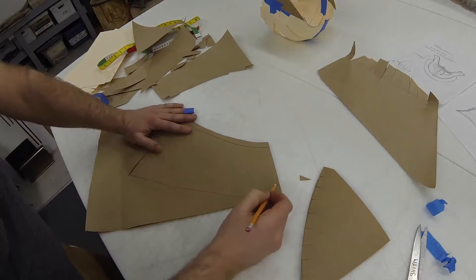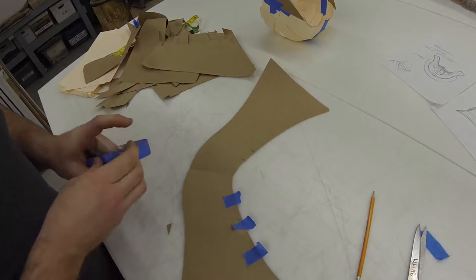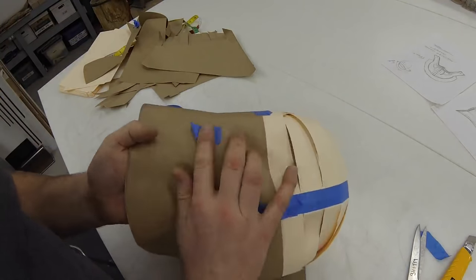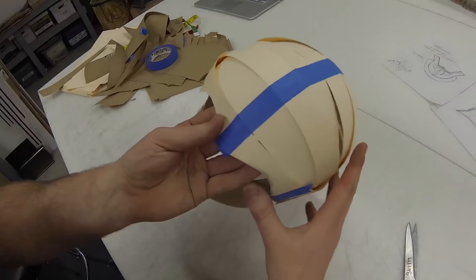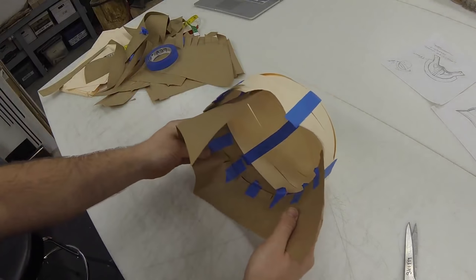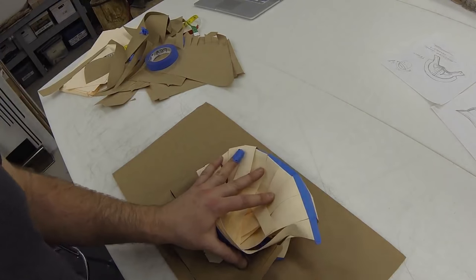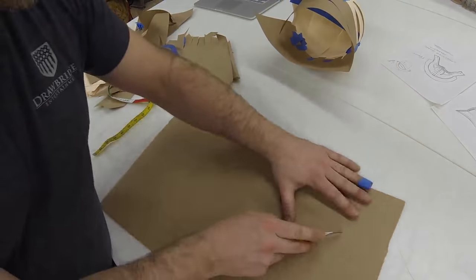The idea of doing a paper helm like that is so that you can get the dimensions of the metal before you cut it, and know exactly how much clearance you're going to have around the skirt and around the skull from side to side, front to back. You get a pretty good idea of what it's going to look like. So I basically squished it down and I'm creating a flat paper pattern. Now I'm going to trace that onto steel.